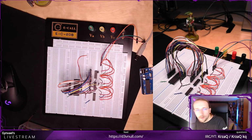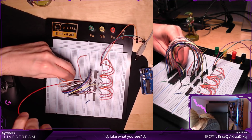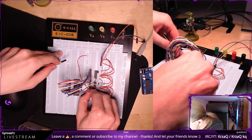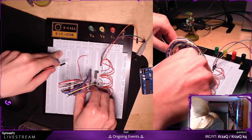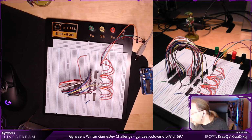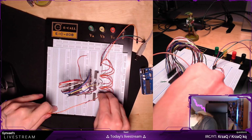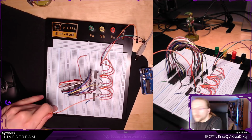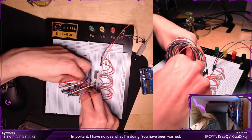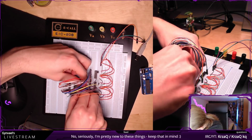A15 is also here on the left side. Okay. And that's it for this shift register, which makes sense because A15 means we already used 16 out of the pins. Then next one is a second pin. Second, correct? Is this second? Yes, it is second. We connect to A16. Where's A16? It's in between of these pins, which I already have connected. Okay, perfect.